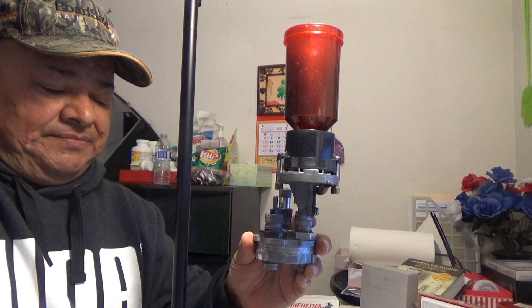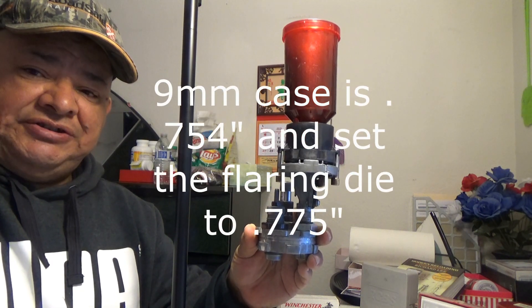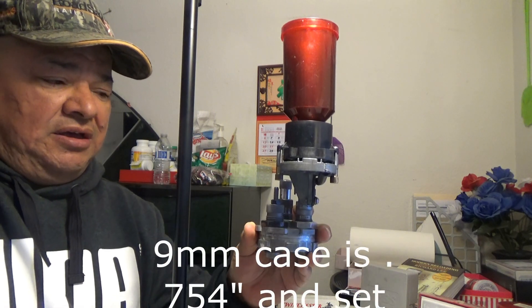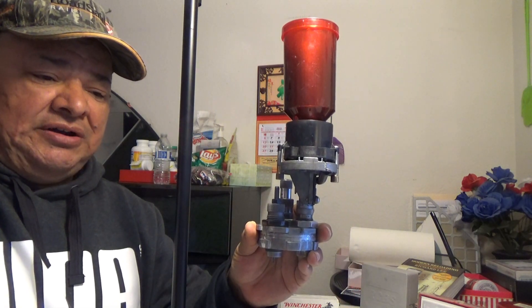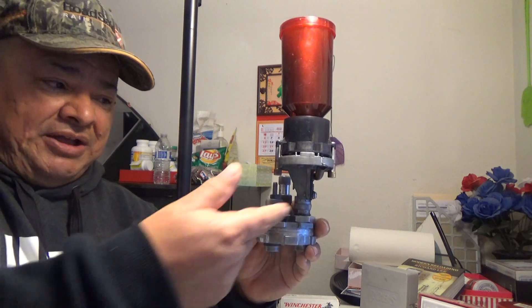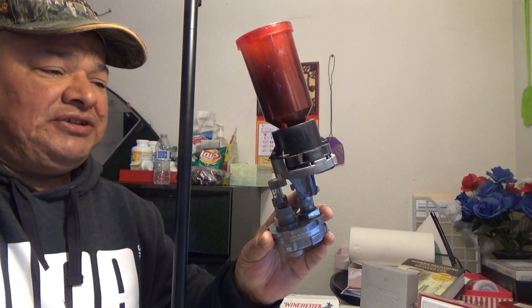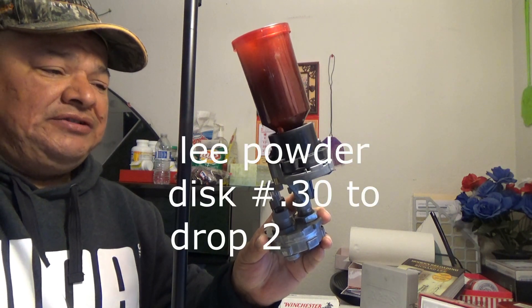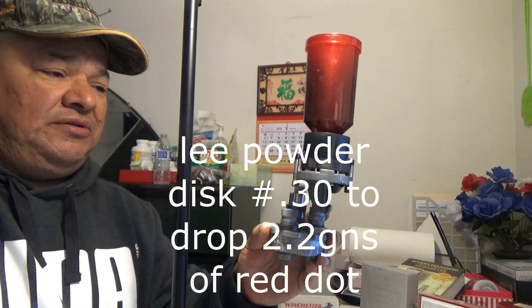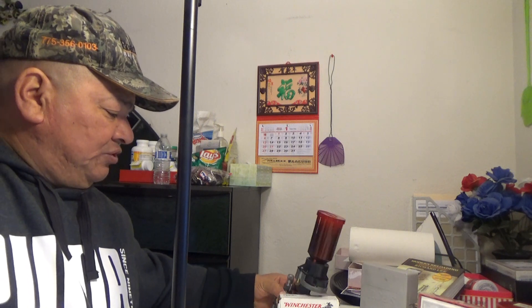I had to adjust the height of the expanding die to match the 0.775-inch shell. Nine millimeters are 0.754, so I adjusted it to match up the size of the shell. I used a number three — actually a 0.30 diameter charging hole for the powder disc — and it threw out a perfect 2.2 grains of red dot every time, from the first to the last round loaded.